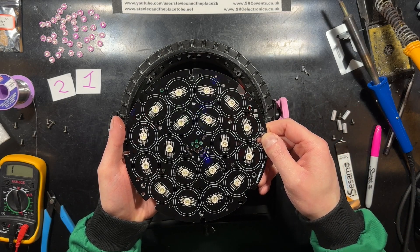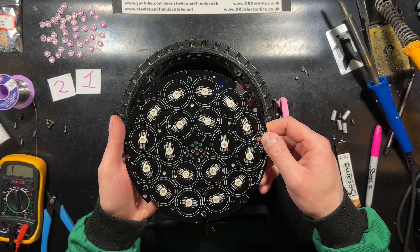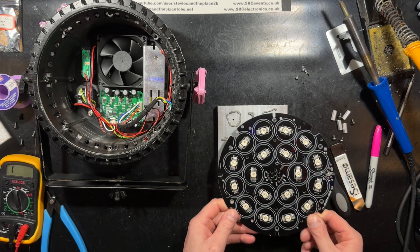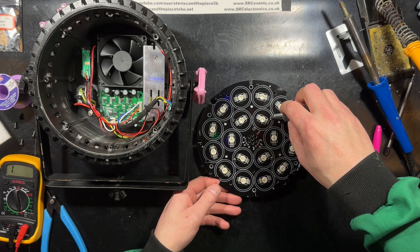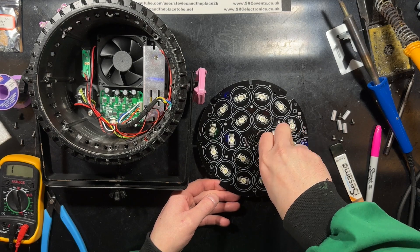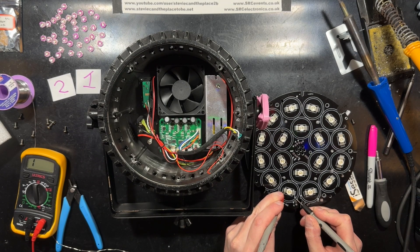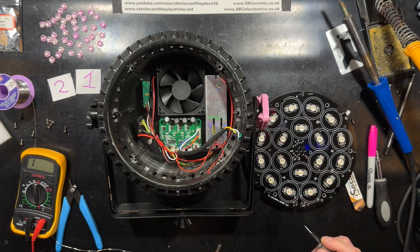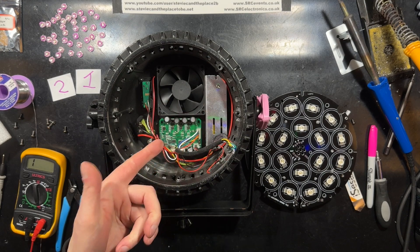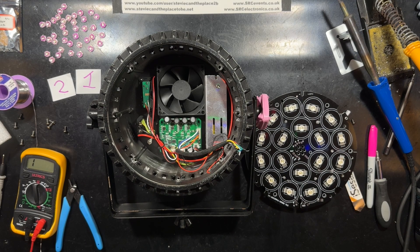I'm provisionally aligning the PCB and heat sink just to check that the holes line up. I don't have any large tubes of heat sink compound left, so I'm using these small syringes. Then I align the PCB up with the heat sink and screw it down to smoosh the two surfaces together. I'm checking that the silk screen markings actually match the LED polarity — and indeed they do. I've read reviews that the green channel has been swapped with another color, which appears to be the case with the old LED PCB. It's worth mentioning that the color codes on the wires don't necessarily relate to the colors they drive — it's just a color code, it doesn't mean it's assembled correctly. But in this instance, everything is labeled correctly.